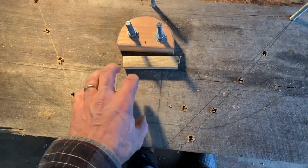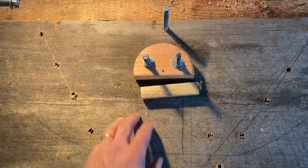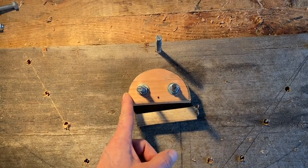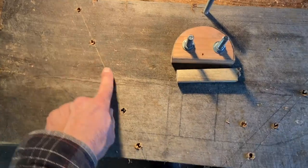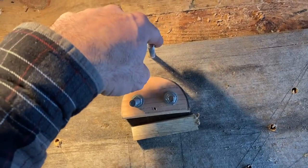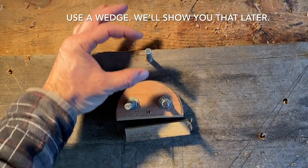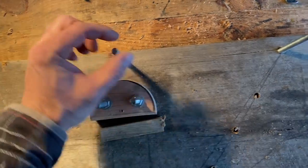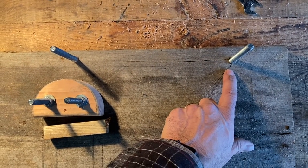You could make this so that these are interchangeable, but I have it bolted in here for now. The idea is to get a good, solid, large enough hardwood piece of plank. You've got your pattern in the middle — this will give you your arc for your bow with the correct width. Then I put peg holes all the way down from one angle down to the other. And there's a pin in the center which should hold the bow in the center so it doesn't pop up.